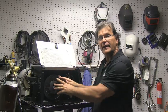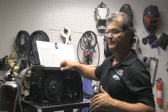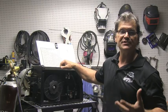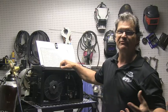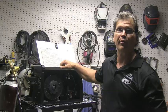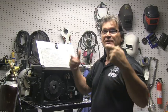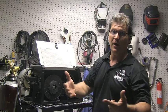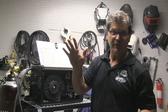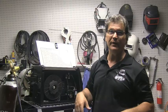The spool of wire here is .030, 0.8 millimeter — ER70S6. It's got a lot of silicon content in it, which helps with welding over thick mill scale. The silicon scavenges the crud and floats it to the surface, which is why you see those little brown islands on the surface of the weld when you're done. That's also why you want to wear eye protection when MIG welding — that stuff pops off. I've been to the nurse's station before with a hot piece of silicon in my eye. Wear your safety glasses under your helmet and you can avoid that.